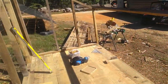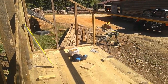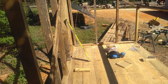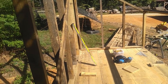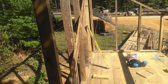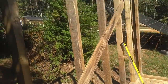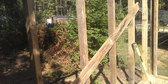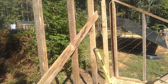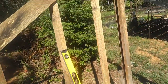Making a little progress, getting closer. I'm debating how I want to do siding. I was originally going to do board and batten, then lap siding, but I might just do T1-11 and glue it in so I have fewer joints. I hate to do it but it might make sense — it'd be more efficient than all the leakage from lap siding. We'll keep moving forward and I'll give you progress.